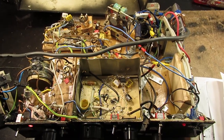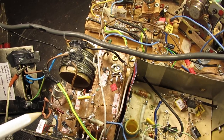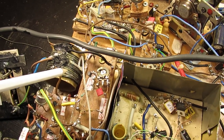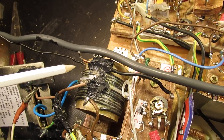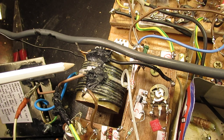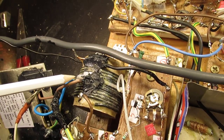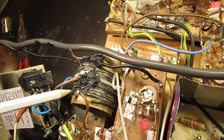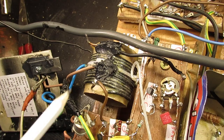This is a more or less classically made radio with a front end that's here, with these windings, that is the antenna coil, consisting of plastic insulated copper wire, 1, 2, 3, 4, 5, 6, 7, 8, say 10 windings with taps.